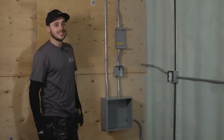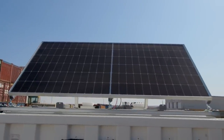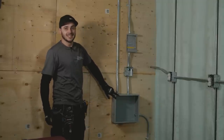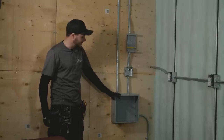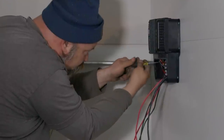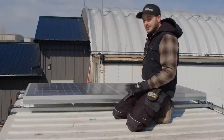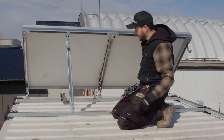We'll check out the conduit that Travis has piped in for our 12-volt — actually 48-volt — solar panels on the roof. That comes in through the side of the container rather than drilling holes through the roof. The wires wrap around, come in through the conduit into the breaker, then to a junction box with DC line and load buses that head down to the battery bank. We've built a little bracket to retain those batteries during transport. From there it feeds the scale and the lights through conduit heading back to the other side. The panel is bolted down with just two half-inch bolts for transport to keep it horizontal and not catch wind.